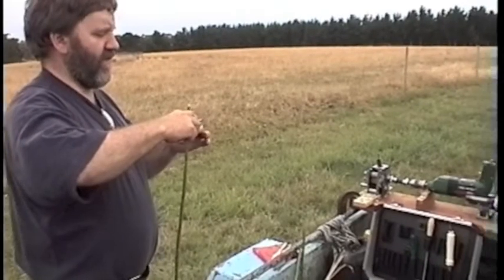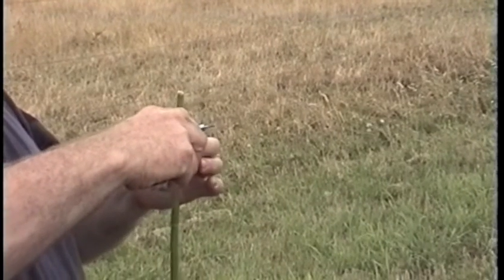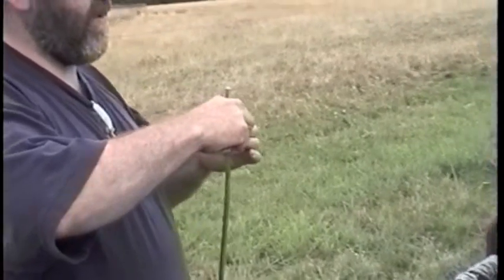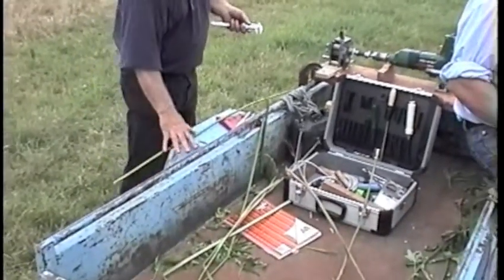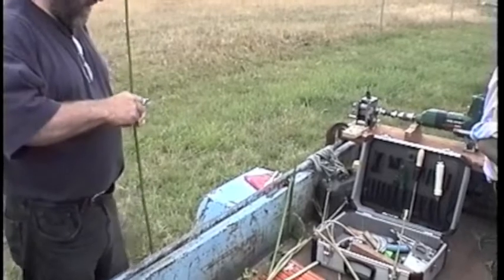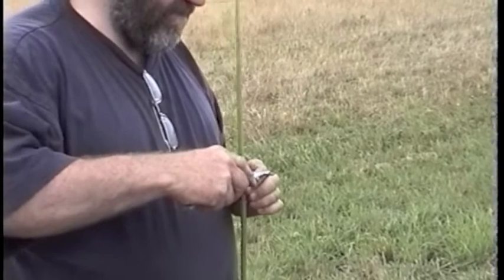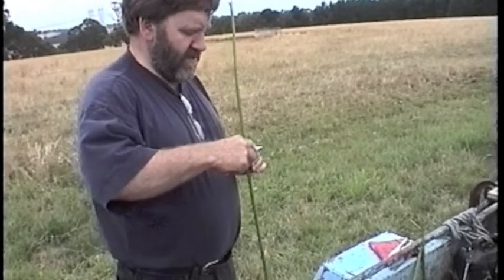For the non-circular stalk, 50 millimetres from a cut, 50 millimetres above the ground, the diameter varies from 8.7 millimetres to a maximum of 9.4. And 900 millimetres further along the same stalk, the diameter varies from a minimum, that is the dimension between flat anvils, of 7.1 millimetres to a maximum of 8.3.